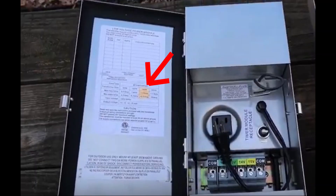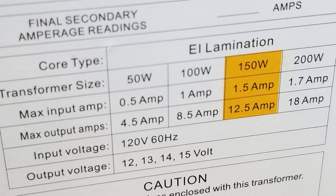One of the things you need to check is amps, or amperage — that's the power the transformer is utilizing for electricity. If you have a high amperage, that means the transformer is working pretty hard and will probably wear out a lot sooner. A transformer has a certain max amperage it can handle. A 300 watt can handle about 2.5 amps, and a 150 watt is usually about 1.5 amps. For bigger installations with longer wires, you might have a higher amperage even with fewer watts.